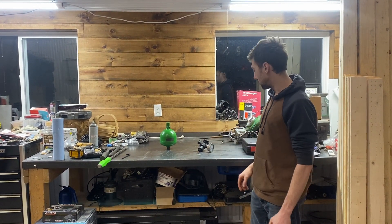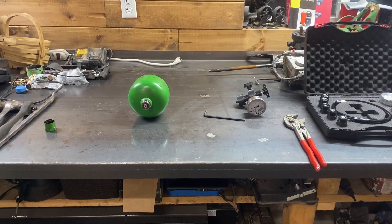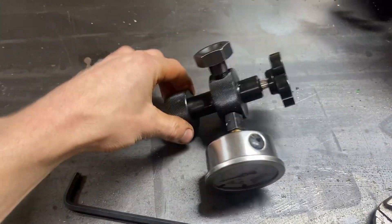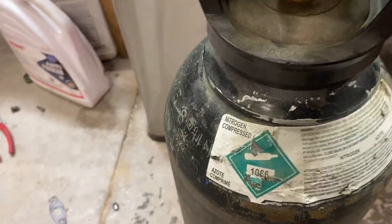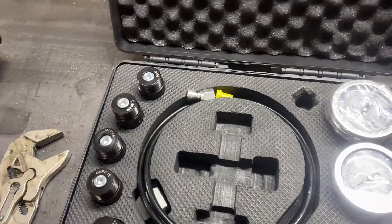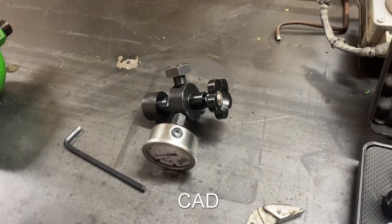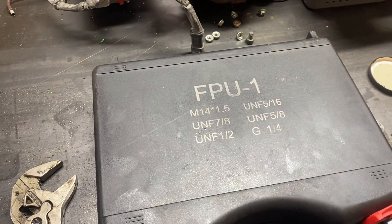As far as charging it, you need a few special tools. The whole reason I'm making this video is to help somebody in the future save a trip to the dealer for charging these accumulators. You're going to need compressed nitrogen and compressed nitrogen only — don't use any other gases. And then you need your accumulator charging kit. The Deere part number is JT03515, but that's about a thousand dollars, whereas a generic accumulator kit is a lot less from any online retailer.